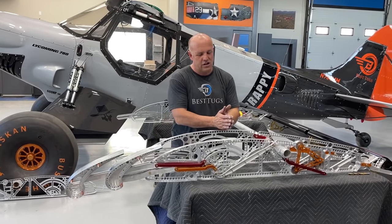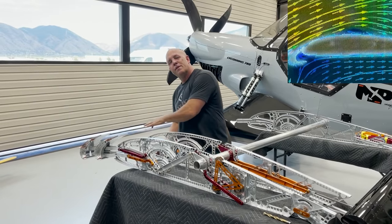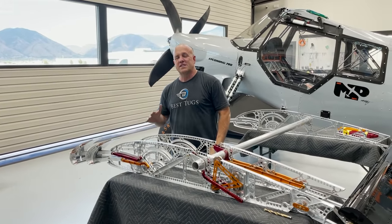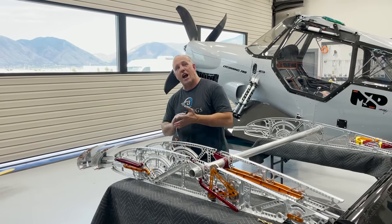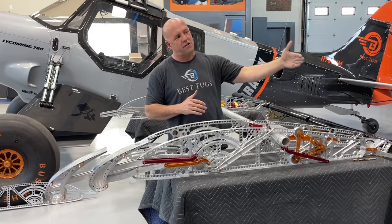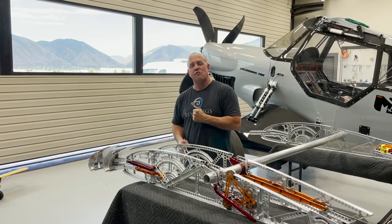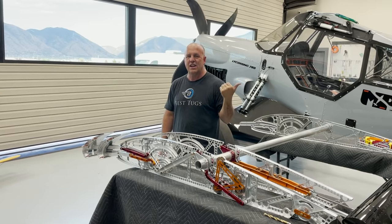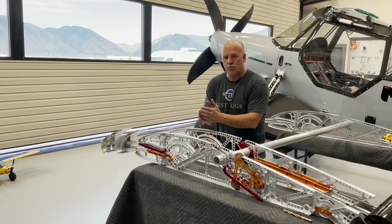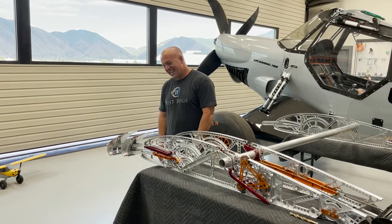So when I started designing how to move that, I started working with a single slat or a single droop, and it worked to an extent. And if you're doing big flaps, I strongly encourage a single slat at least. Maybe retractable is great. But on Scrappy, with how big my flaps got and how much lift I wanted to create with a drooping aileron, one wasn't enough. I still needed so much aft stick, I was giving up a ton of lift to counteract that induced load. So the idea of manipulating two components in direct relation to the movement of the back is where this silly idea came from. Anyway, I'm really excited about it.